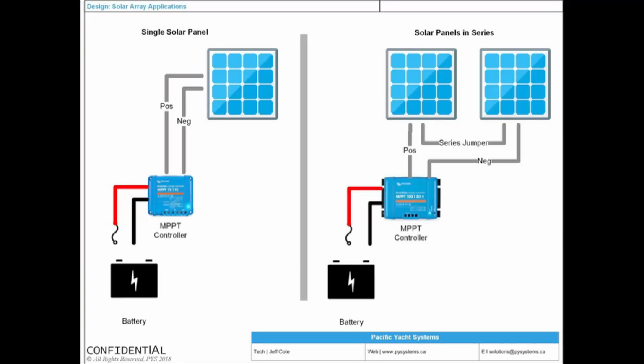We have this set up in the booth. If you're curious, you can see both. Literally, we have this exact setup in the booth, not a coincidence, where we have two solar panels wired in series, and then you have only two wires going to the controller, and then two from the controller to the batteries. But notice how I have a fuse here. Very important to have a fuse at the battery. Very, very, very critical.